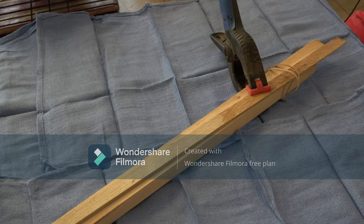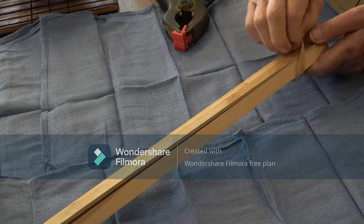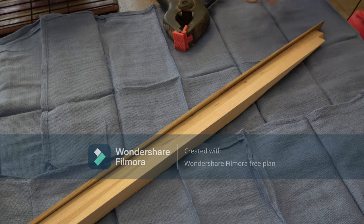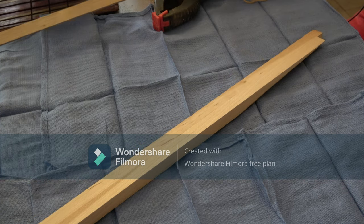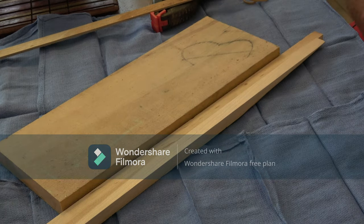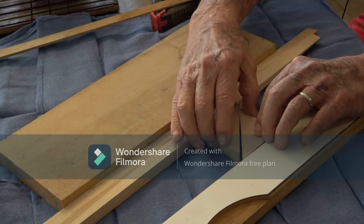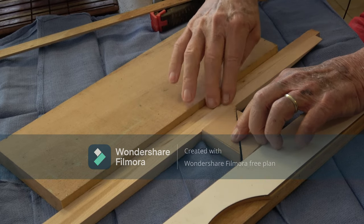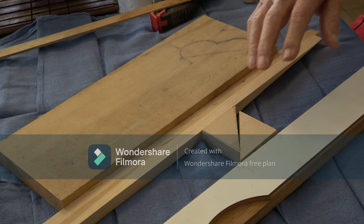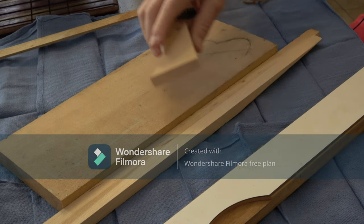Another way to do it is through some homemade devices using wedges, where you actually compress two pieces together by having a block of wood and sliding the pieces against each other, which presses them together. The wedges are at 45 degrees, but you'd want more of an acute angle to get the pressure you want at the point you want.